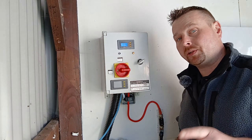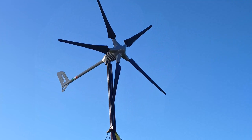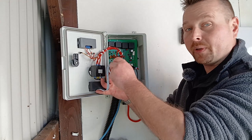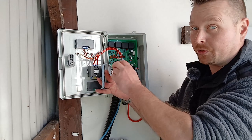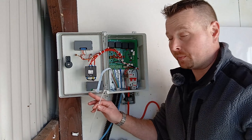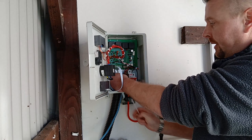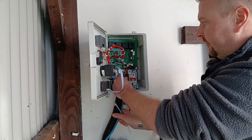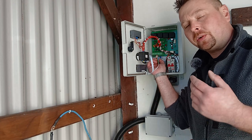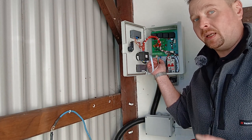To disconnect the turbine while it's in operation, the first thing you want to do is apply the brake. Once the turbine has stopped spinning you can then open up your control unit and loosen off the three terminals from each phase. The wind turbine operates three-phase AC so each of these is both a hot and a neutral at the same time. To keep the brake applied when you disconnect these three wires is real simple — you just need a cable tie. We're going to use the cable tie to join them together. Having the three phases joined together like this creates an opposing magnetic field within the windings of the generator itself, meaning that it can't spin effectively, acting like a brake.